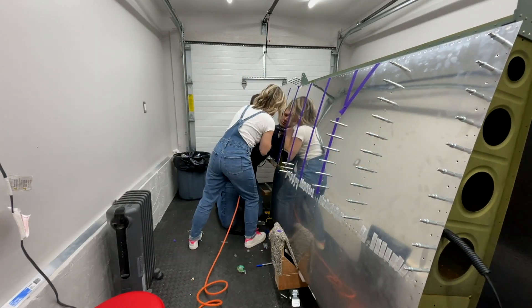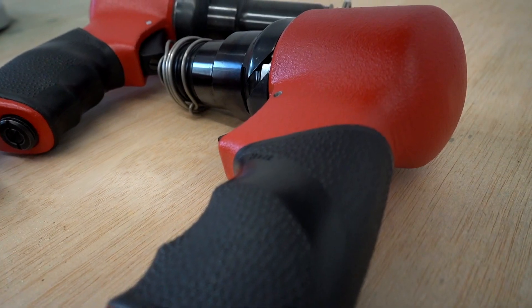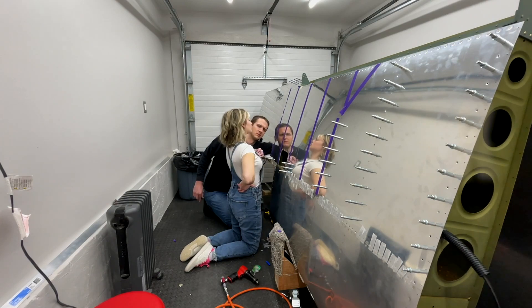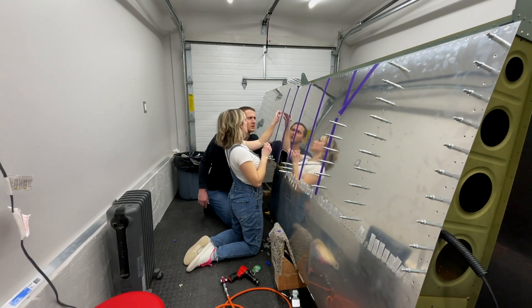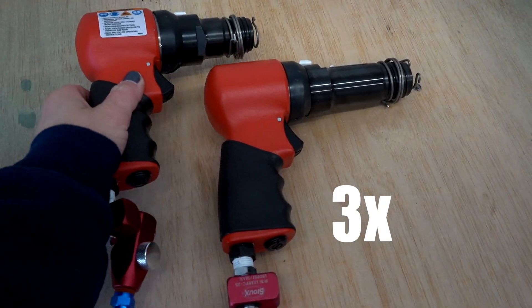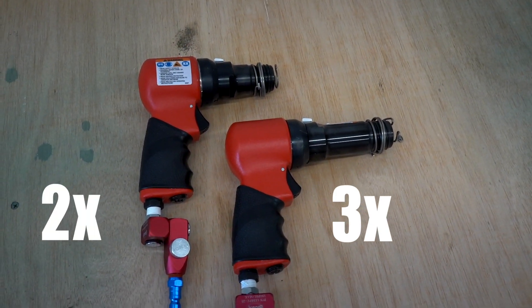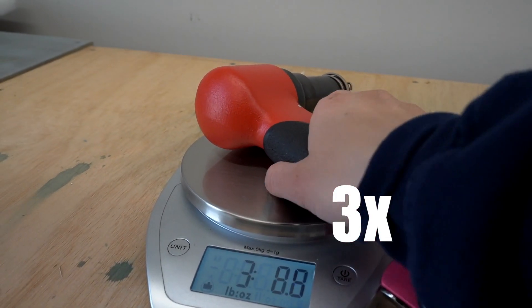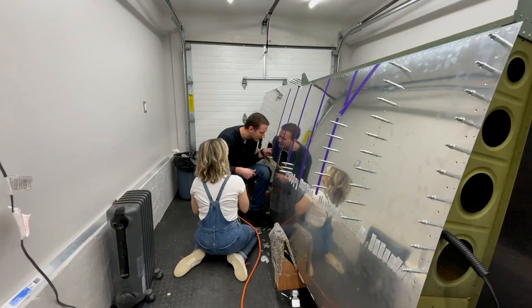This would be a good time to talk about the rivet gun. It actually took us a while to figure out what type of gun we wanted to buy — we went back and forth two or three times. There are so many discussions online, but we decided on the 3x gun. While we could have finished the entire project with it, it is slight overkill for the size of rivets you use for the wings. I personally felt like I didn't have full control until we broke down and bought a 2x gun midway through, which is slightly smaller and gives lighter, more blows per trigger squeeze. Me feeling comfortable with the 2x lowered my stress level, and definitely Cliff's as well.